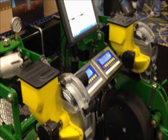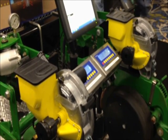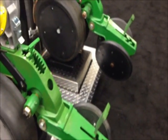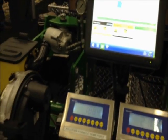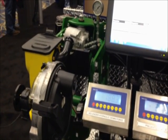Auto SWAT is also utilized with our hydraulic system. What we've found is that when you want to enter an area such as a waterway or an area that's already been planted, you tend to have your rows bouncing because you're in an end row, or they want to come out of the ground due to sod. We've incorporated the Auto SWAT feature so that it will actually deactivate the downforce and keep it in a hold pattern any time you enter these areas.